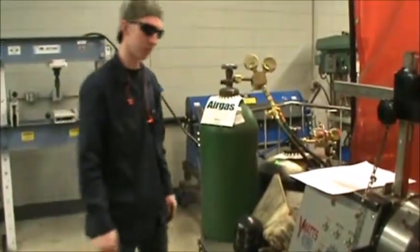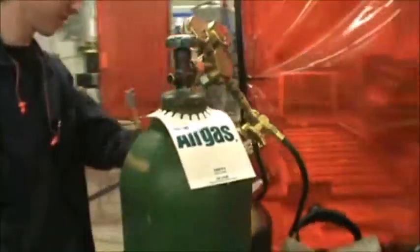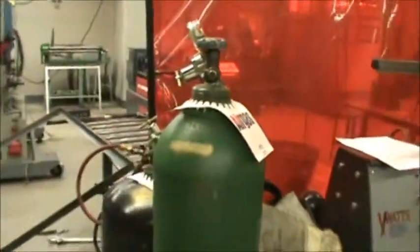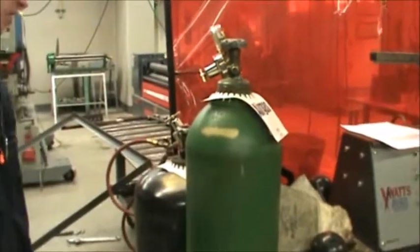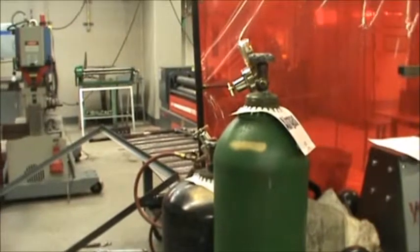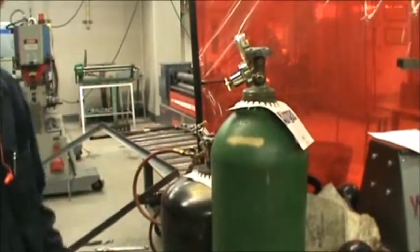The acetylene pipe cutter, turn your acetylene and oxygen all the way up. They are good to go. How far do you open the acetylene bottle? Acetylene go, today I'm running at 10. But how far do you open the bottle? Quarter turn. Sounds good. How about the oxygen? All the way. Sounds good. Then we move over here.